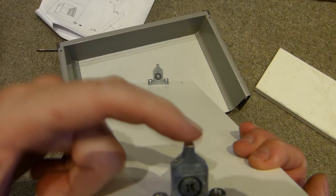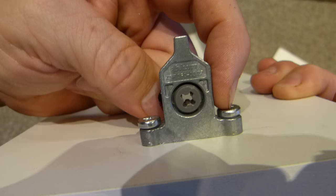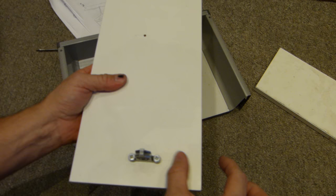If you want a different drawer than the original, like I said, and these are different sizes now, you can see a little higher, this distance on this particular bracket here, and this is what I mean, it's different from what's in the manual. Don't worry about it. Screw center to screw center is 32 millimeters on this particular hardware. Make sure that the left side and the right side are the same distance away from the edge. Make sure they are the same distance away from the top.